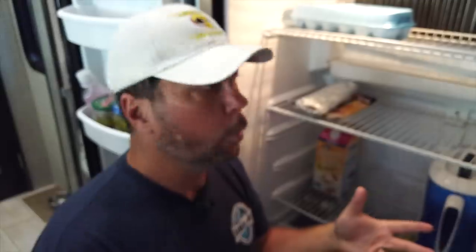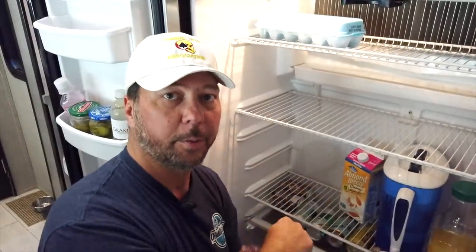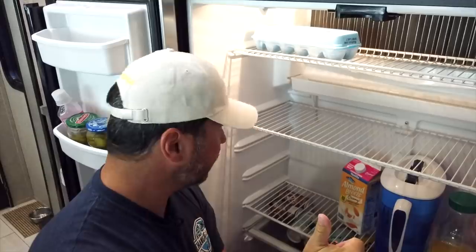All right, so let's jump on to the inside of the refrigerator and then we'll go to the freezer. You can see that from having our refrigerator open, we're getting quite a bit of moisture in there, and that moisture is accumulating on our fins and dropping into our drip pan as designed. This tube is pretty snug, and getting it attached to the back of this drip pan can be a bit of a pain, but you want to make sure that's on there, otherwise it's just dripping down to the bottom of your fridge. So we're good to go there.